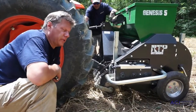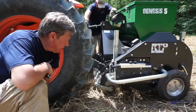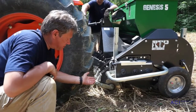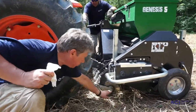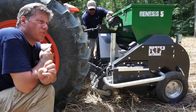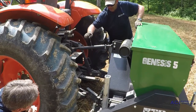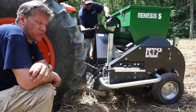Now that we've set our pin setting at one inch, with the type of ground conditions we have, I think we're a little too deep. One way we know this is by looking at the optional front cutting knife — it's running about an inch to an inch and a half in the ground. That tells me the machine is nosed over and forcing those cutting discs too deep, which means we're probably running a little too deep with our seeds. So we're going to extend the top link, pushing the top of the machine up and back, raising that point out of the ground. Because we have a seed mixture of soybeans, sunflowers, foxtail millet, and sorghum, we're going to shoot for around half to three-quarters of an inch deep in this ground. We'll rock the machine back, make one more seven-foot pass, and then we're good to go.